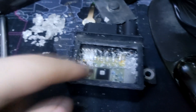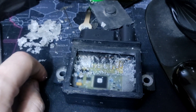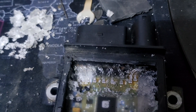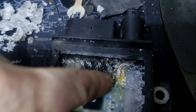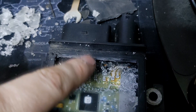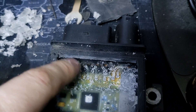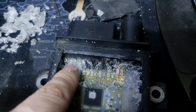Now we're inside. You need to take all of this silicone out, because basically what you're going to be doing is replacing these wires — this is where the problem is. It's not a simple case of taking the wires off and soldering new ones on. You've got to take the wires off and then see these pads here — you've got to grind away the top until you see copper. I'm not sure how these are put on, maybe they're friction welded or something.